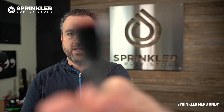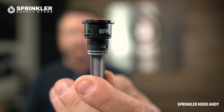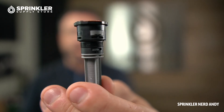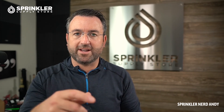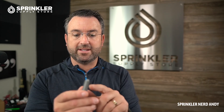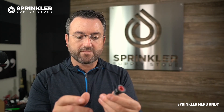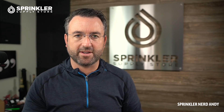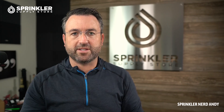I wanted to give you a quick overview to show you what the nozzle looks like. Keep in mind these screens — which is the gray portion here — are built onto the nozzle and not meant to be removed. There are some pros and cons to that. A lot of sprinkler contractors, homeowners, or HOAs that have dirty water can easily, with other brands, just take the nozzle off, pop the screen out, put a brand new screen in, and screw the nozzle back in. With these, you would have to clean the actual screen and then put the nozzle back on because it's attached to the nozzle, and these aren't cheap. So you don't want to throw it away. The screens are pre-installed.